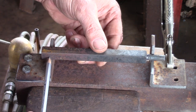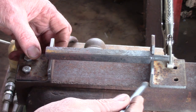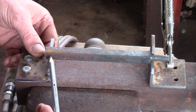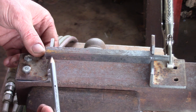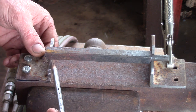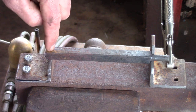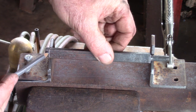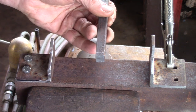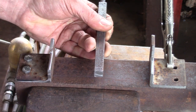Here's how it works. With this end hot, when you need the new tenon, you're going to come on having previously measured the distance that you need plus about a 32nd. Why the plus a 32nd? Because this end is hot and therefore expanded, so you want to account for that. It's okay to upset; it's a little hard to draw out without putting some dings into your bar. So I do the dimension that I need plus a 32nd. Bar goes on, this end is hot, I come with my hand hammer and just give that a bang, turn it over 180. I've got a mark in here now — turn it over, bang. I've got a mark on either side of the bar, and that will go into my butcher dies on my blacksmith helper or guillotine, and I'll be able to isolate the material for the tenon.